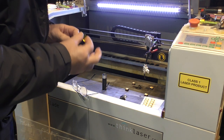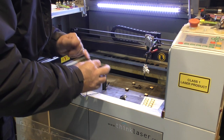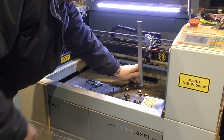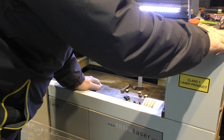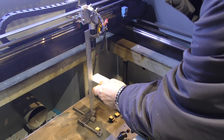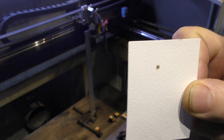When I hold it up to my eye, as I demonstrated in an earlier program, I can see what's in the background very clearly as though it's a mirror, so I know that is the flat side — and I'm going to use it flat side down. I've just got a steel rule here which I'm going to offer up to give me an idea of what the focal length is supposed to be. The top of my ruler at zero is roughly in line with the lens, and this is supposed to be a seven-and-a-half inch lens. At seven and a half inches, I can see there is quite a big hole in there and also it's got a halo around it — that's bad news.